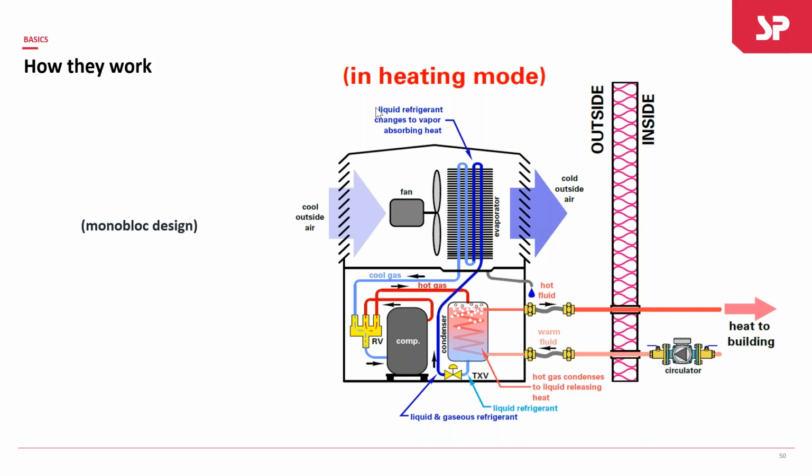So one of the things that we run into, these systems are super adaptable, right? And they're also super protective. And there are times when we may get a technical service call and say, hey, my system's not performing well. Well, the system is only going to be allowed to perform as well or to put out as many BTUs as the system or infrastructure design that's connected to it. So we're going to get into a lot more of that piping and pumping coming up. I just wanted to plant that 10-degree delta seed right in all of your minds.